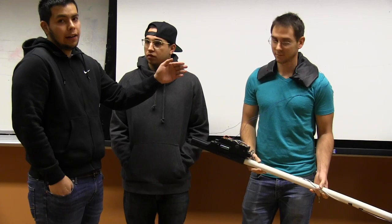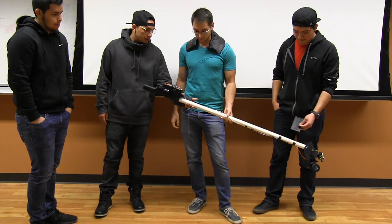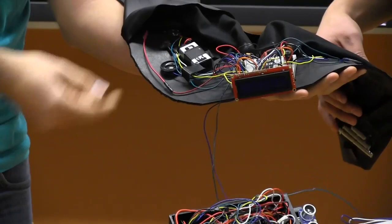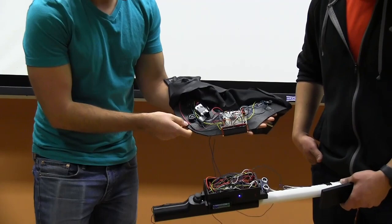If the torso or head-height sensor is triggered, all buzzers and speakers go off at once. The construction of the cane itself is fairly inexpensive — we used a PVC pipe and everything else was 3D printed and modeled. The vibration motors are up towards the front, as well as the LEDs and the power button. We have a few transistors to amplify the vibration motors. We purposely didn't amplify the speakers because we wanted that to be a personal audible sound, not for everyone around. We do have high-pass filters for the speakers, and a 9-volt powering the PIC.